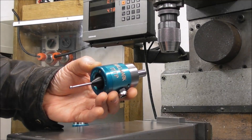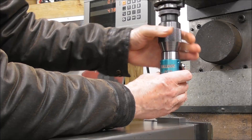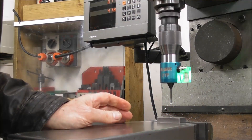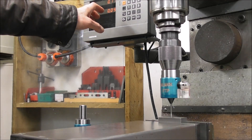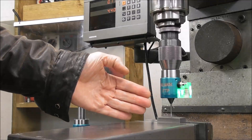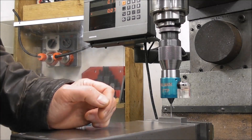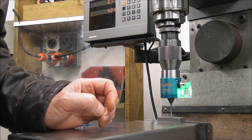Having these different versions of the ITTP allows consideration of different applications. For example, it can be used in a manual mill — not in a CNC mill at all. With this prototype I'm developing, it's a self-contained battery-powered attachment that just plugs in and shows you the trip position. We can use it as a high-precision edge finder, dialing it in really concentric, and when the light goes out we can enter zero on the DRO, index across to the other side, and find the center of a hole or edge of a plate. It can reach into deep slots and cavities, which an ordinary edge finder can't do. Let me know in the comments if you're interested in something like this or can think of an application for it.